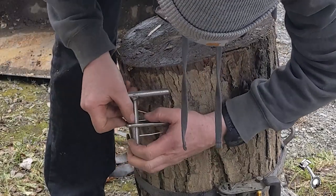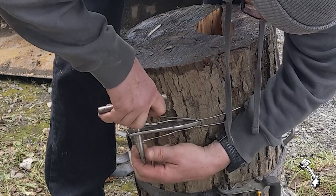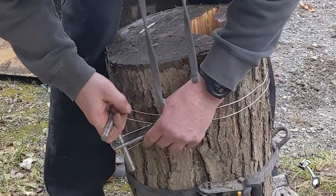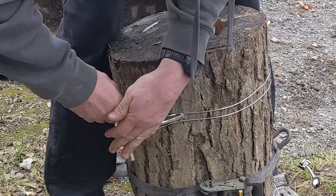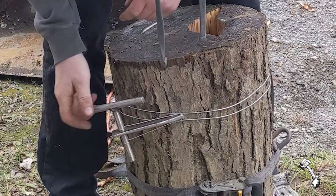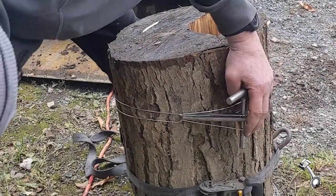It looks like I might not have left quite enough for myself — I'm going to try to squeeze my wires together. Okay, just enough — barely. So I've got some wire poking through, and the idea is you just start twisting on this handle. You'll notice the little notch is on the loop right there, and what this does is draw it really, really tight. The more you cinch, the tighter it goes. I have broken the mechanics wire before, so you do have to be careful of that, but you get it nice and tight. Got about a half a wrap around.